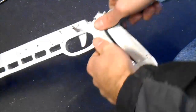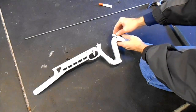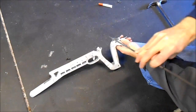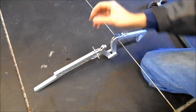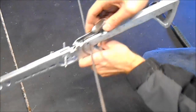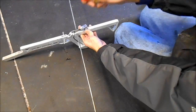You'll want to glue that pin in place. Unfortunately my hole was crooked, but I just bent it straight and made it work — it can wobble a little bit on mine but it works fine. The 29 inch long one goes through here; just make it centered. And I've got this little piece of a spring that's going to go underneath the back of the latch. That will make the latch so that it latches and stays in place and works.